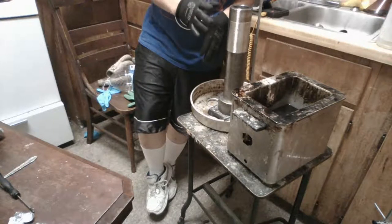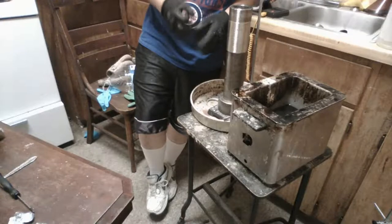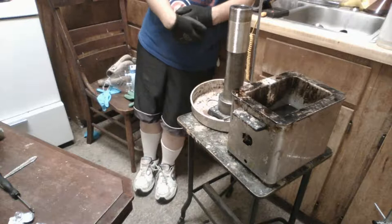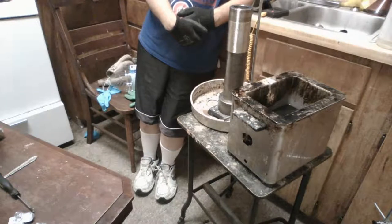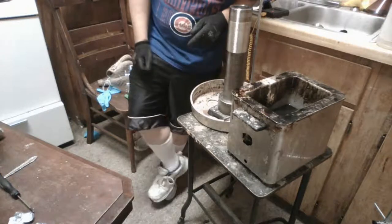This has a metallic soap, so it doesn't just have the beeswax. So there's enough to have it so it cuts, but it's going to be the same hardness as a standard brown wax record. I've figured that out. And with the annealing of the wax, this wax is what you call annealed.